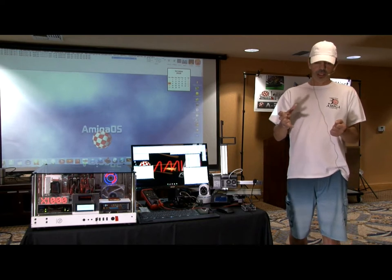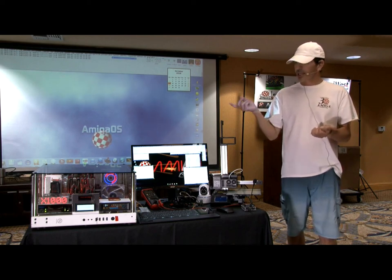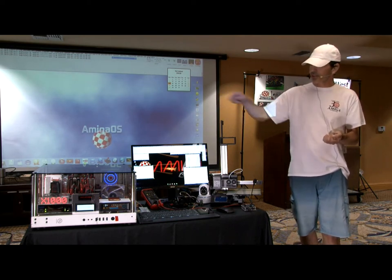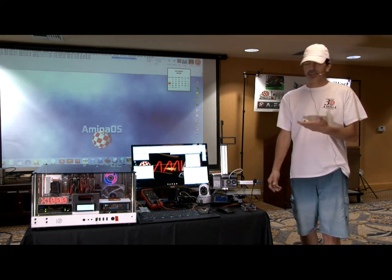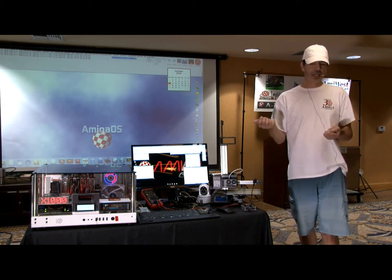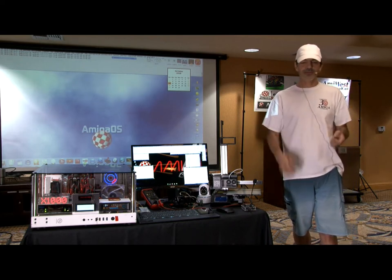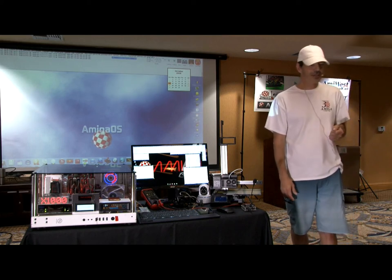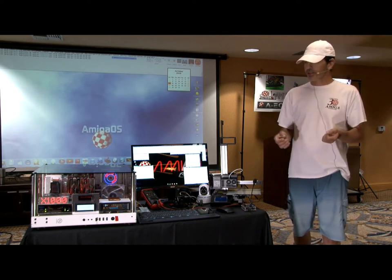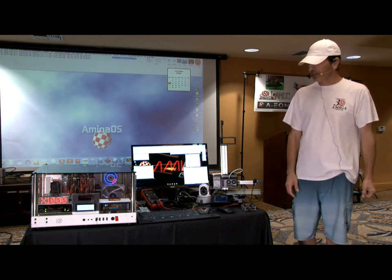The controllers were meant for driving a big motor from a little microcontroller. You can send a pulse at 5 or 3 volts, and it translates to a 12-volt pulse at up to 15 amps, which is enough for the Peltier. Now the Peltier is not very energy efficient — it consumes up to 144 watts just to cool down the machine. For general use it's probably not the best approach, but if you have an environment where it's really dusty or bad for the computer, it's the best solution to just have no interaction with the air.